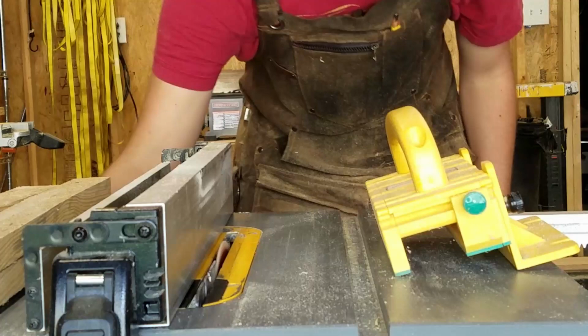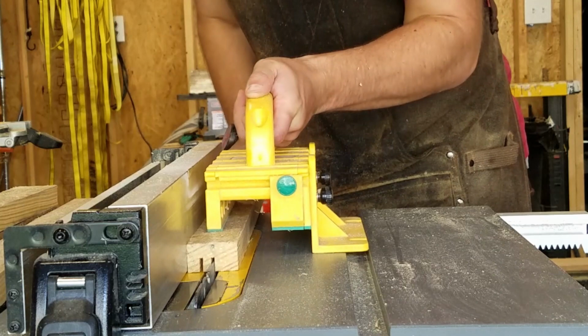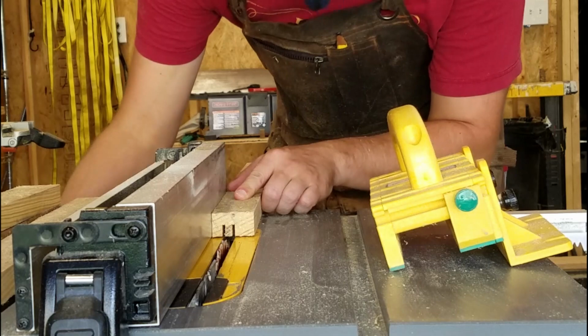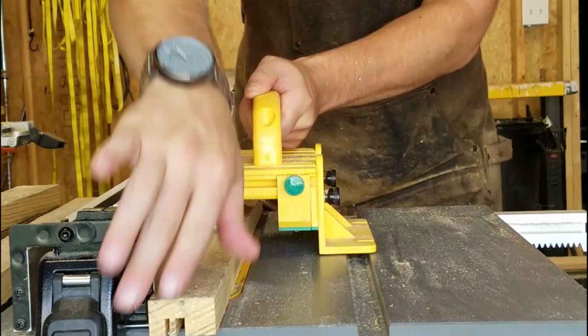Success. So next I'm going to set it to 3/4 inch and I'm going to flip the piece of wood over a couple of times and make a cut. Now what I'm doing is marking the outsides of my channel. So you can see that the 3/8 inch is going to be on the inside and the 3/8 is on the outside there. And I'm just going to start cutting away all that wood and ripping it down so that I now have a nice channel.